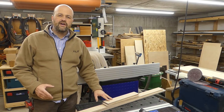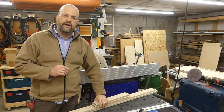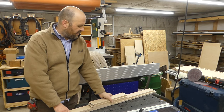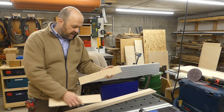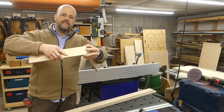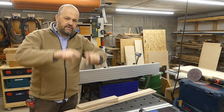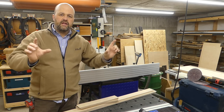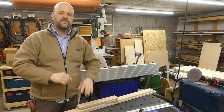Now the parts for the carcass are ready for glue up, but one thing occurred to me that I should do before I glue up the carcass, and that's gluing up the toe kick. That's going to be basically just a frame out of these 7 centimeter high plywood pieces, and I'm going to glue them up to be a closed frame